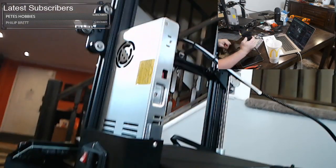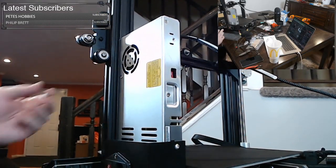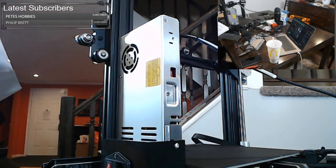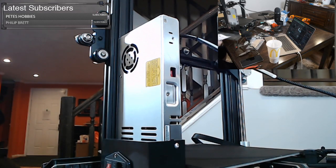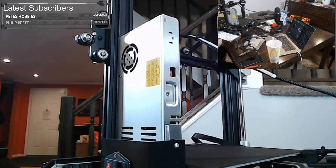The whole i3 design was actually built around the idea that the printer will have some play in it. A lot of people like to say the i3 design has some issues because it's not very stable. But they discovered it actually prints better having some slack in some areas than some other printers do. If you have a printer that's too rigid, then other things start to crop up as being problems. Things that the i3, being not as rigid, is able to absorb through small movements.